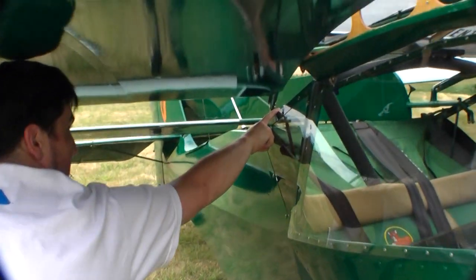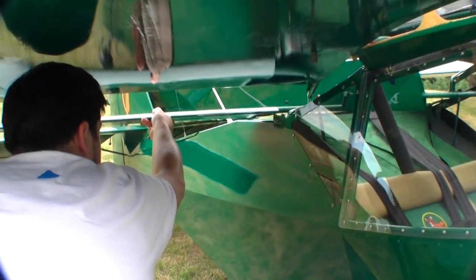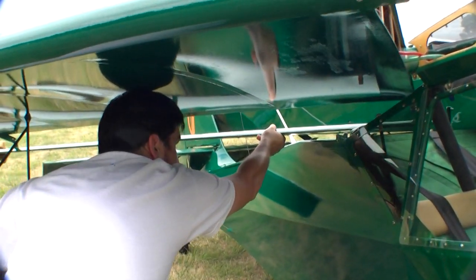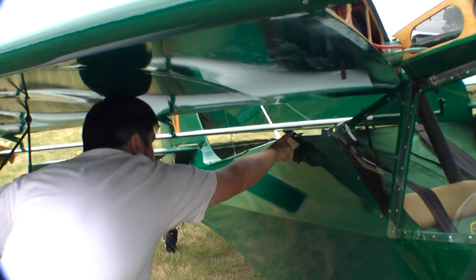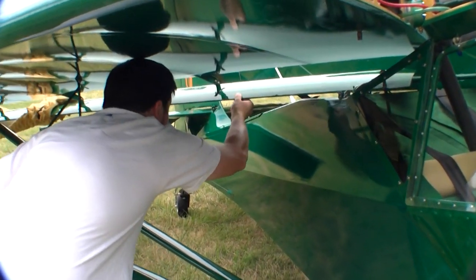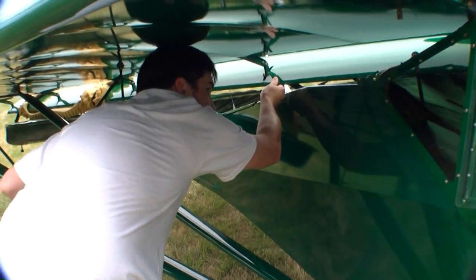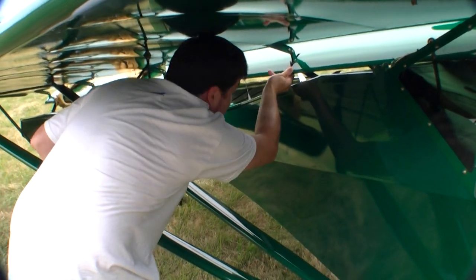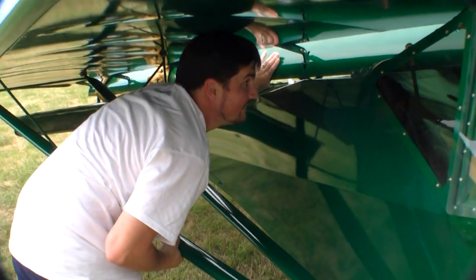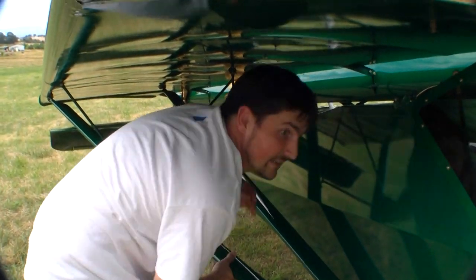Again, I'm watching this — it's out of my way. I've got to keep this flaperon perfectly flat, otherwise it will hook there and hook back here on this turtle deck mount. Again, I start going vertical, just really slow, watching from this position. From right here you can see anything that's going to hit. And then continue to rotate, rotate, rotate — and there they are, they're folded.